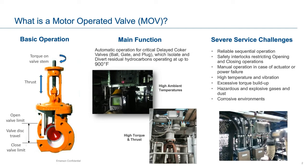In case of actuator or power failure to the motor, a means of manual operation requiring low effort to stroke the valve must be included with the actuator. Due to the severe service nature of the applications, an electrical and mechanical design that will resist high temperatures and vibration is important to ensure long-term reliability. The hydrocarbon or coke will begin to build up in the valves over time, so proper sizing of the actuator to overcome excessive torque buildup without exceeding valve stem allowables must be taken into account. Finally, resistance to hazardous and explosive gases and dust, in addition to corrosive environments, must be considered when selecting the proper motor operator.